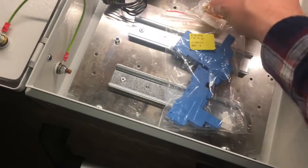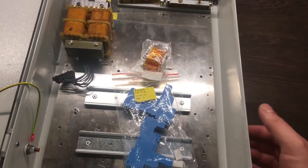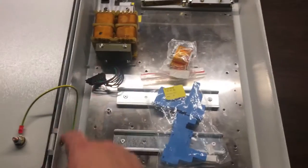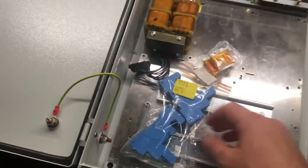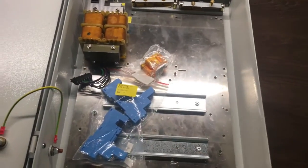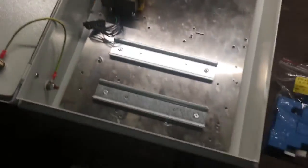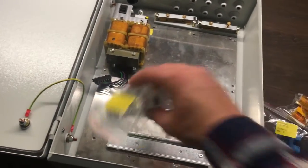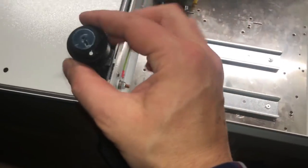One relay is for the mains and one for the heating coil. This side will bring in power from the mains for the heating element. The other side — I haven't really made up my mind yet — but for example for all the controllers and for the pumps, which will run out the bottom. So I'm going to have two split power systems connected in parallel via these relay breakers. These are the two main breakers, 16 amps on the DIN rail. I have two manual key switches, one for each power side, so nobody gets hurt.